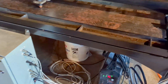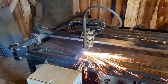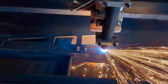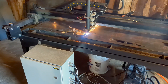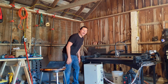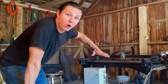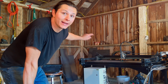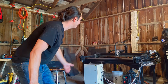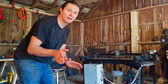This is a customer order piece and was the first piece I cut out with the new Z-axis. Without it, I would not have been able to do this. It's nice to look back at your hard work and be able to be proud of something. This piece was just about at the max of my cutting area — about 50 inches wide — and I think it turned out great. I had to hold it down with my hand as the torch was cutting because it started to warp and come up, but it cut all the way through everything and it actually looks kind of crispy.